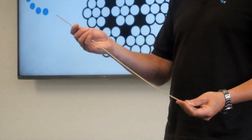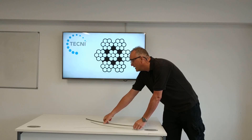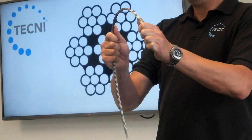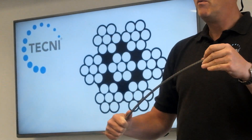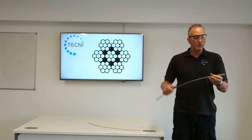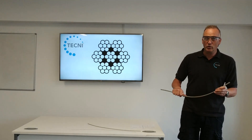It's nice and easy to work with on-site — you can see you can form loops in this 4mm pretty easily. When it gets to this sort of diameter, 8mm, you probably don't really want to be trying to form loops in the end. You can see it's getting really stiff and difficult to actually form an eye in. It's probably better to use swageless terminals with this type of product. You could, if you have a hydraulic press, fit thimble eyes in it still, but not on-site really — it's starting to get a bit more tricky.